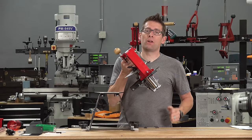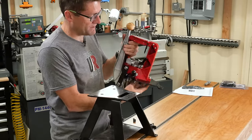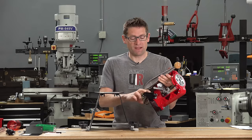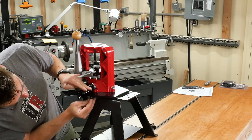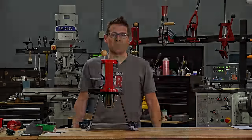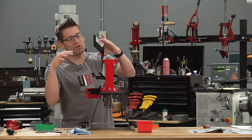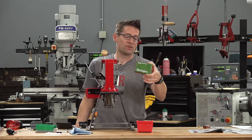Installation of the Loadmaster on the inline fabrication ultra mount quick change plate is pretty straightforward — just three countersunk screws that come in through the bottom. One detail that's a little different for the Loadmaster is there's an accessory bracket that uses one of the mounting bolts to keep it in place, and the factory Lee bracket bolts to that, giving us a place for the completed cartridge bin. Use two wing nuts to secure it to the ultra mount. We start the assembly by optionally installing the explosion shield; if you're not using Remington or CCI primers, Lee recommends putting this in place.